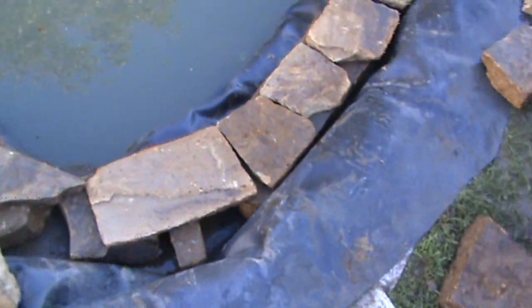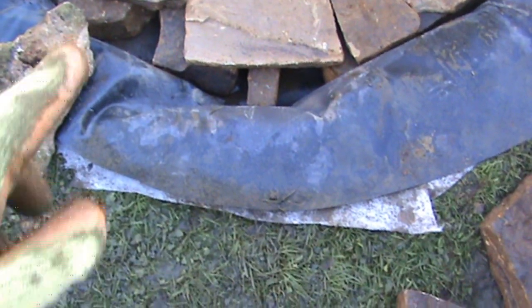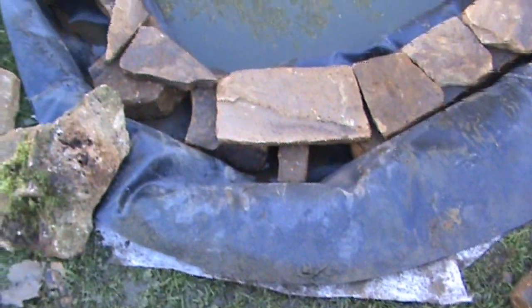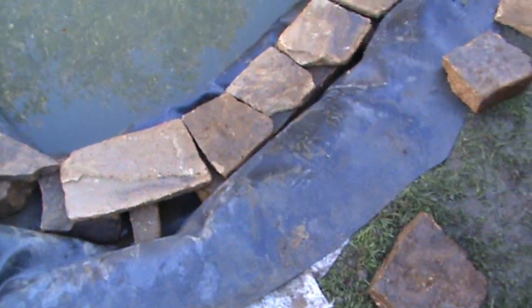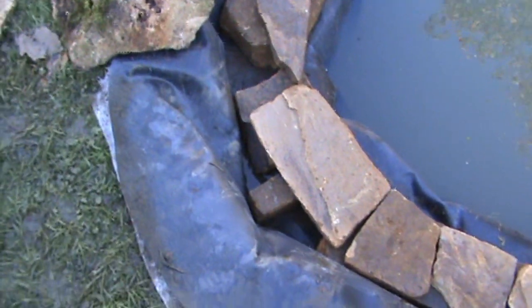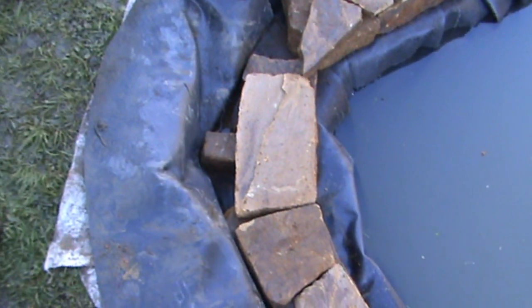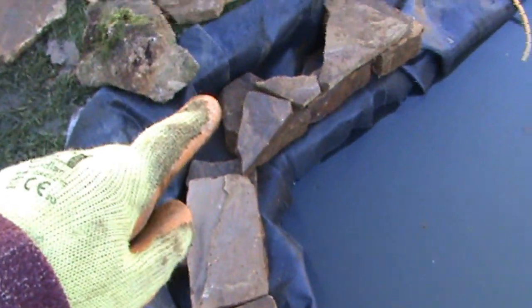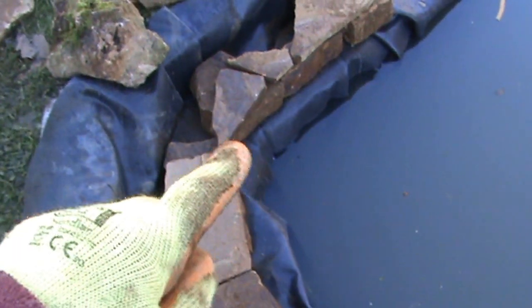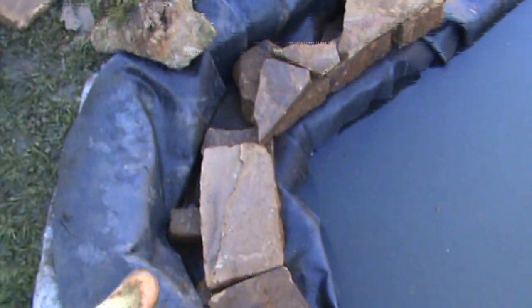On top of this wall we're going to use nice big flat sandstone pieces, which should come kind of around here. So they'll straddle the wall and the grass. We'll obviously have to dig out certain sections to be able to fit in these stones, but they'll be cemented on the top of the wall. The good thing about building a wall like this is, when it's cemented on the top it's going to be very secure, perfect to walk on - it's not going to fall into the pond. And you've got all these gaps behind the wall; with it being a dry stone wall you've got little gaps between the stones where frogs and newts can get in - excellent places for amphibians to hibernate.